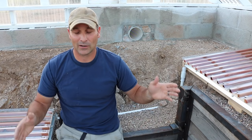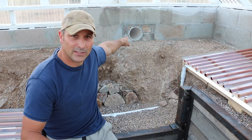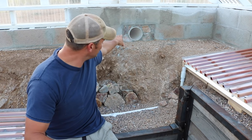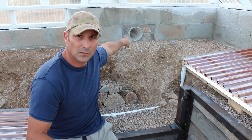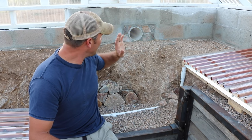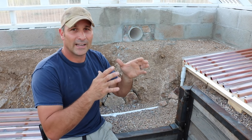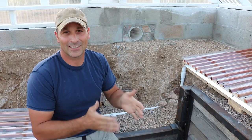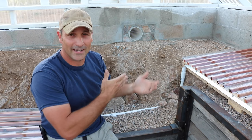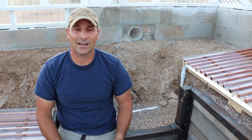On the next update I will show you some plants growing in this greenhouse, and I will also talk about the cooling tunnel. As you can see, I have a six or eight inch PVC pipe protruding through there — I just mortared some rock around it and it is buried about a hundred feet out into the desert. I don't have the inlet for the airflow yet and I don't know if I'll have that for the next update. The rainwater harvesting system is pretty much all finished — I just need to paint the pipes and pretty it up a little bit.